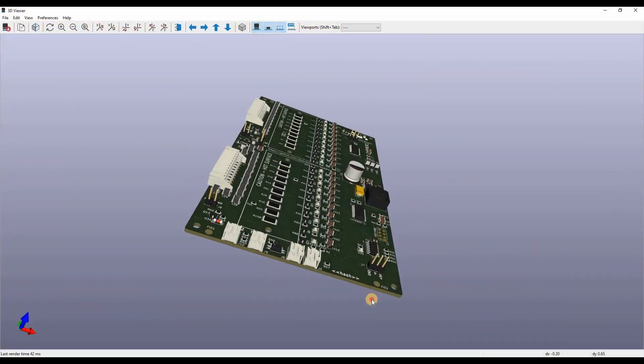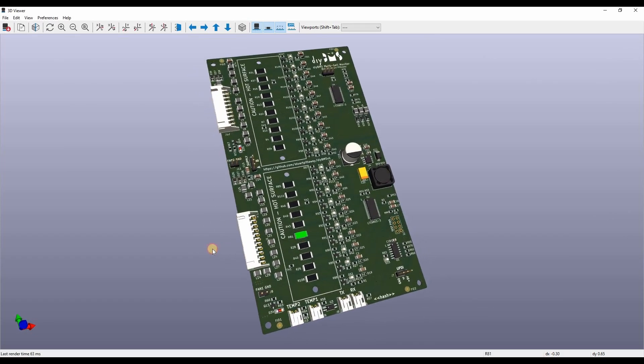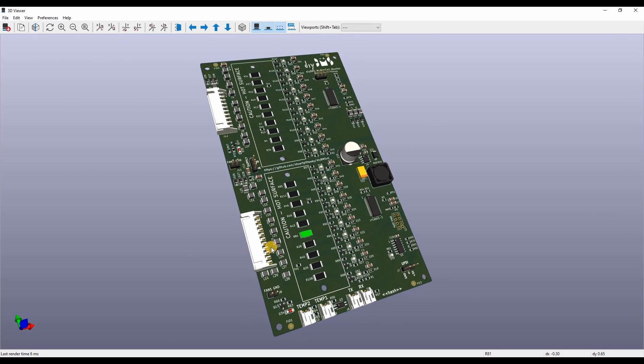I went back to the design stage and prototyped a stackable design using two of those LTC chips, supporting up to 24 cells. But again this seemed overkill and not many people want a 24S monitoring solution. There are also a lot of issues with actually obtaining the LTC chips I used on those prototypes. So I put that design on hold for six months or so, and last autumn I started taking a look at a different approach.